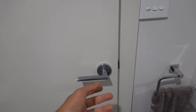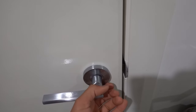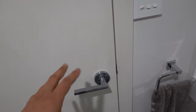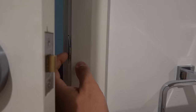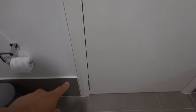Now we know the door is sitting just a little bit too low. Close it and try lifting up slightly on the door — you'll hear a click, confirming it just needs to sit a little higher. Since this is a new property, we don't want to remove the latch and chisel out a section. We want to make this as clean as possible, so we're going to raise the door slightly. We've got a hinge at the top left and a hinge at the bottom left.